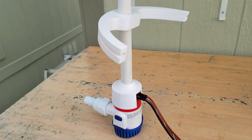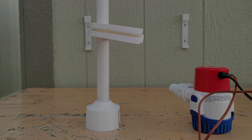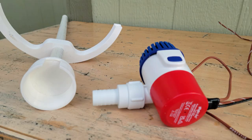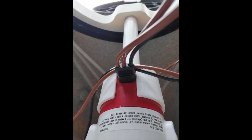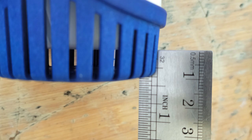The Rule pump is an automatic pump but without a float. What it does is every two and a half minutes it'll turn on for a second to sense for water. If there's water it pumps; if there's no water it sits idle for another two and a half minutes. This is all done with a very low power draw. Plus the pump can draw water down to about 3/8 of an inch or less, which I think is pretty impressive.